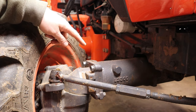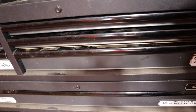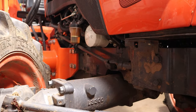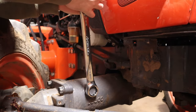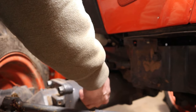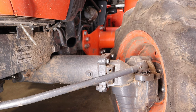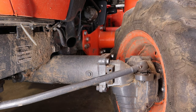So right here — we're going to refer to this as the passenger side of the tractor — this is going to be the fill plug right here, and we're going to have to open this up. It's a 27 millimeter, but you don't need a full wrench; an adjustable wrench would be fine. Then the other side is the driver's side where you actually get on and off the tractor. You can use a 14 millimeter, and that little bolt there is going to be your check plug.